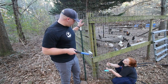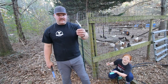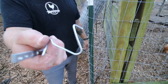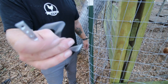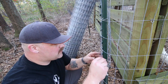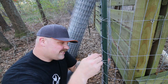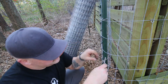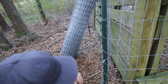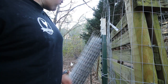For those of you who don't know, I have a love-hate relationship with these little staples. We always need them because they are inexpensive — these little galvanized staples — but round staple, rounded head of hammer, they don't work that great. The clips look like this — there's a long end and a short end. The easiest way to do these: take the little side, go around the back, hook it around your fence. That gives you a little loop. Take your tool and stick it right in there, bend it up around — and that typically works. Looks pretty good.